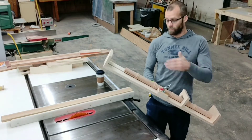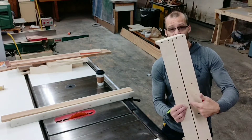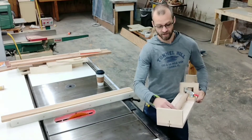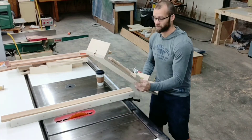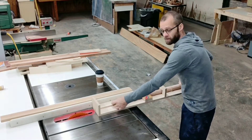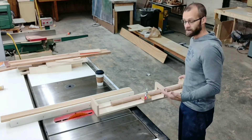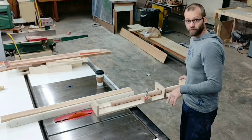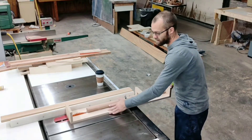Because we make one pass through here, we have a nice clean line within our tool that we can use as a reference point so you know exactly where your blade is going to cut. Your spindle is going to be centered in here — in my case it's about three inches. Set the height of your blade to the center point of your spindle. You should already have that center point from where it was made on the lathe, so it should be easy to index off of that. Make multiple cuts if you have to — three or four cuts to get it just right to center — because it's very important.